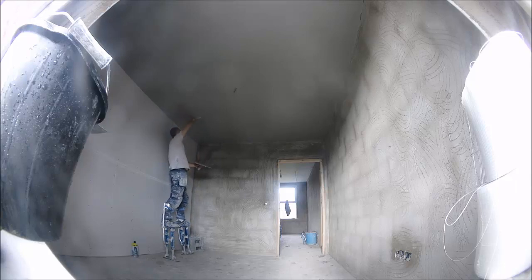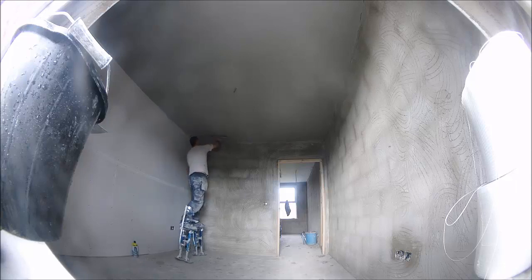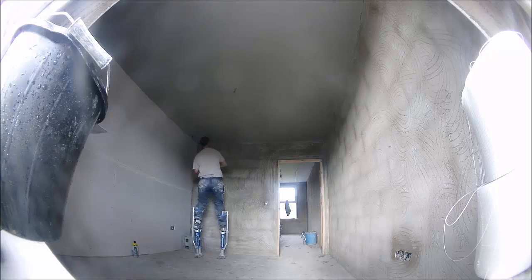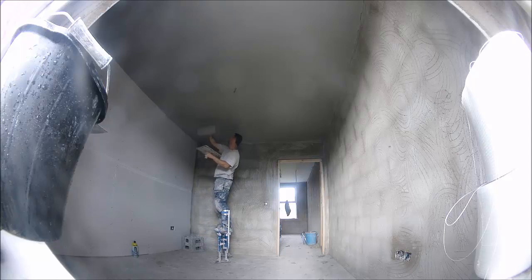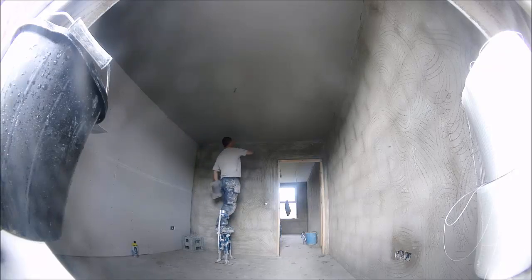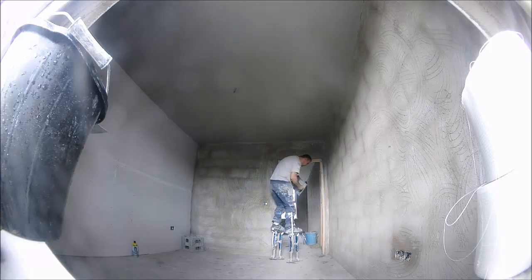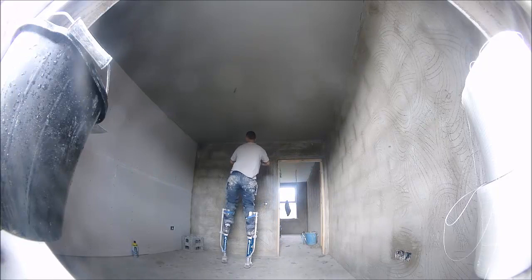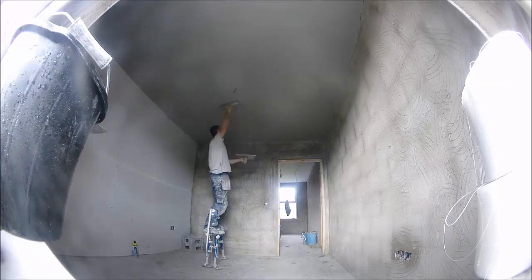Once you have all your first coat on, you might want to mix a fresh batch for the second coat. You don't have to wait terribly long before your second coat, but some plasterers like to give the first coat a quick flatten. As I'm doing a few ceilings I just coat it as neat as I possibly can and second coat straight onto it. But if there are any big lines and the stuff's starting to tighten, give them a quick trowel before starting your second coat. Start your second coat where you started your first coat so the ceiling sets uniformly right round.